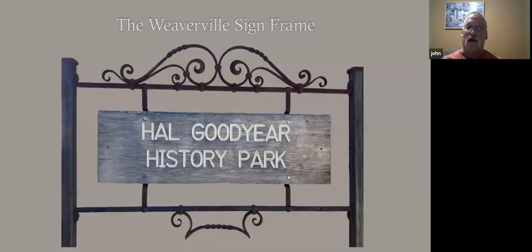Here's a picture of the finished sign, a close-up of it. You can see it's got the scrolls from the level two grill in it — they're shaped a little different. It's got upset corners on the ends of the horizontal bars, upset corners where the vertical bars intersect with the sign, tenons on the end of those, and collars and punched holes.